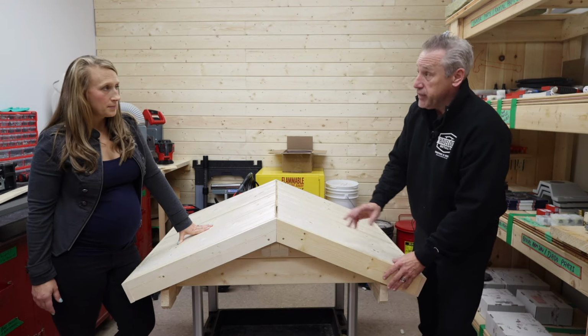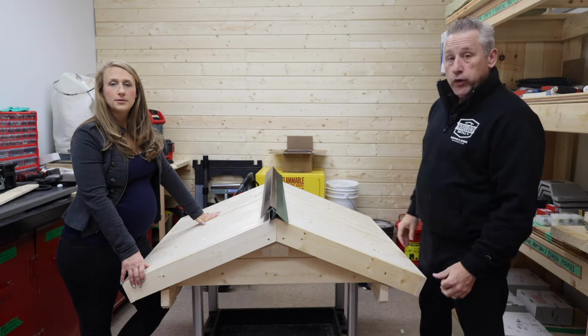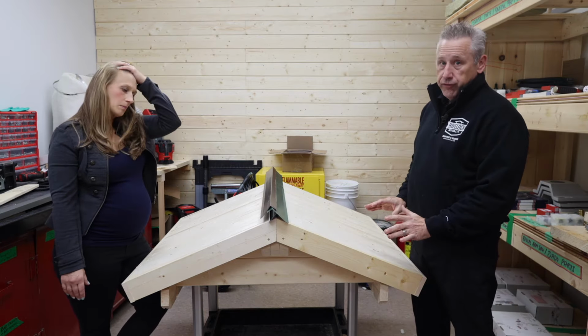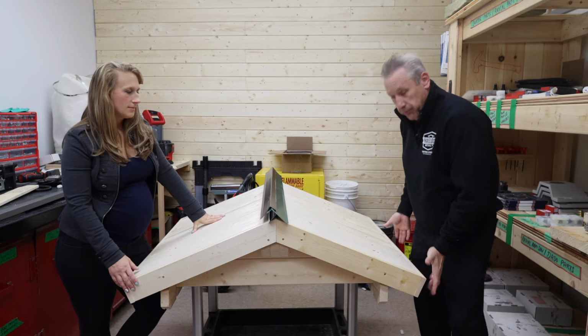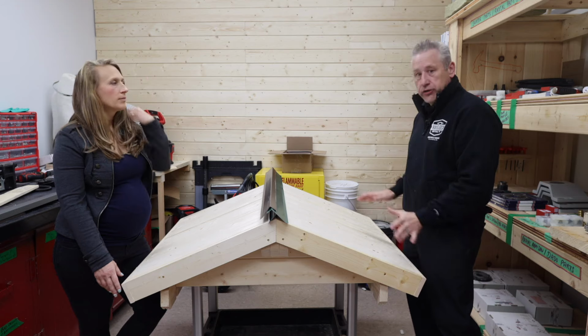Yep. And we want to protect those edges. So the panel, if you didn't have a flying gable, which we'll look at examples of now. Okay, so when cladding your roof, it's bottom up, always. Water rolls downhill. We want to make sure everything is getting layered in that direction.